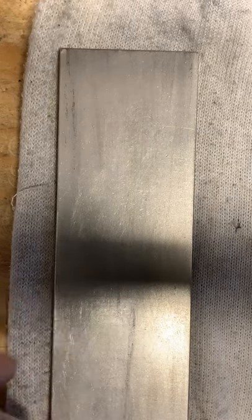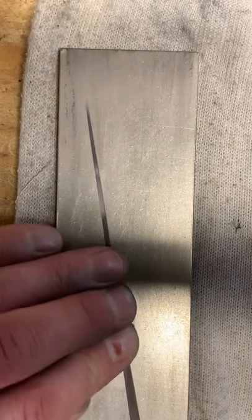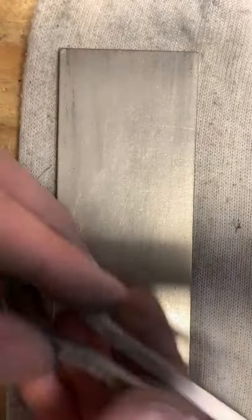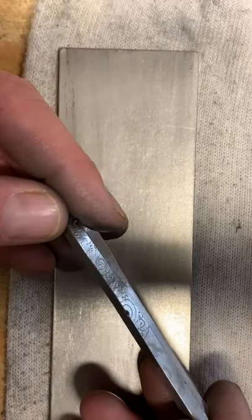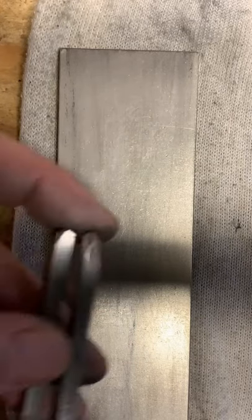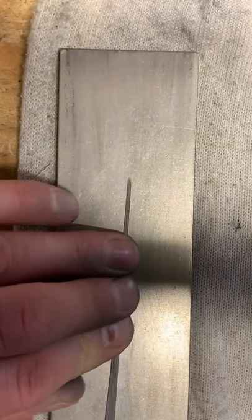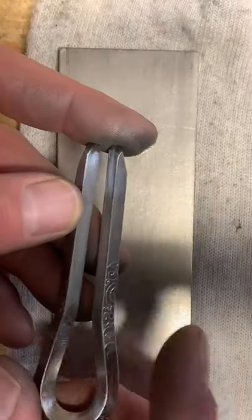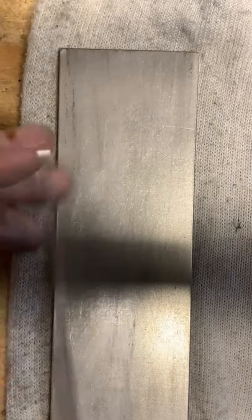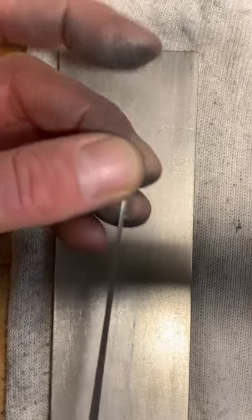It sounds like I'm rubbing it on glass - it's just putting a nice polish on there. To those of you who are first joining us, this is the harp that's going to be going on - it's going to be purple when I get done with a big tail. Tempering is referring to what I do with heat that gets harps to turn purple and gold. It's a colorful and protective oxidation that occurs on the whole frame. I'll have more adjustment to do after I temper it because it's going to release the stress of these bends, so the entire frame is going to be tempered. When I do my knee bend and my quench, it's going to be quenched and hardened, so I need to temper it back as well. That makes my reed vibrate better too.